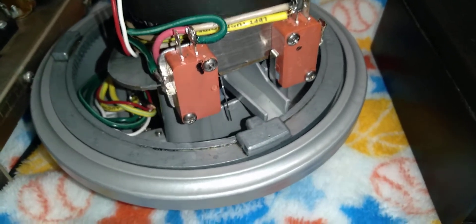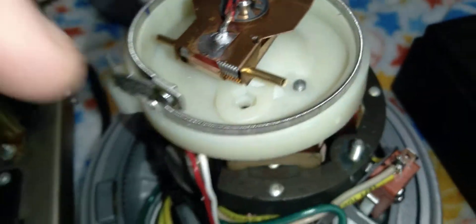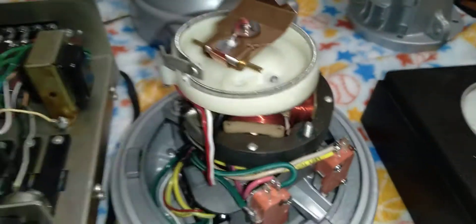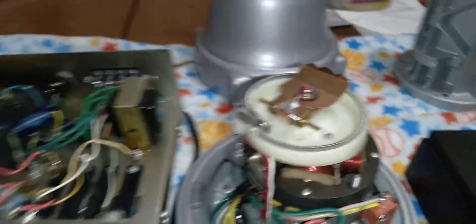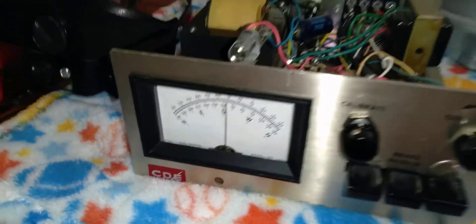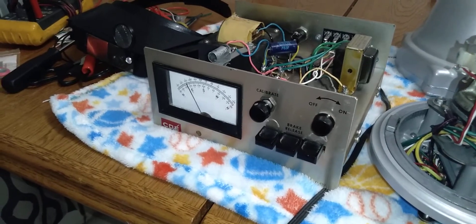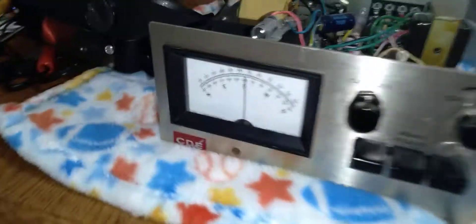While that's moving, you see these lugs? There's three of them. They fit up in these. At the very top of that, it's got a notch in it. There's a notch on the potentiometer. This is just like you find in your gas tank, and there would be a float hanging on the end of this — when it would turn, your gas gauge would go up and down. Just like this, if I turn the potentiometer, the gauge goes up and down. It gives me a heading, in increments of five degrees.